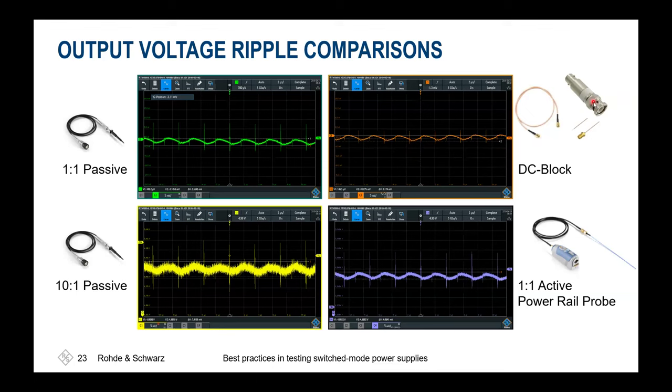If you're having an external DC block, you might get at least a specification. Typically for oscilloscopes, the internal AC coupling is not specified, so you'll have no chance without using an external signal generator, performing a sweep, seeing when the sine wave you're entering there gives you the full amplitude again. But that would be additional effort. That's why typically we do not recommend to use DC blocks if they can be avoided.